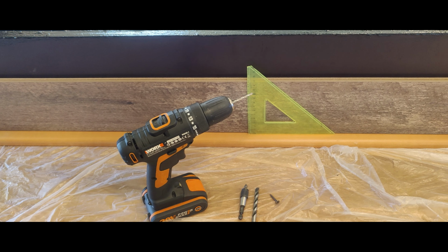Now, normally these kind of wooden panelings have these special claws that you mount on and support your panels, but we're gonna have only 2 layers, and the second layer of wooden paneling actually comes over the edge here, because we'll have another profile that will support our glass. So the claws would come here and hold the other layer in place, but we don't have any support here. So I'm just gonna employ the same method and screw it directly onto the Tego sheets. It won't look that bad and the screws will be barely visible.